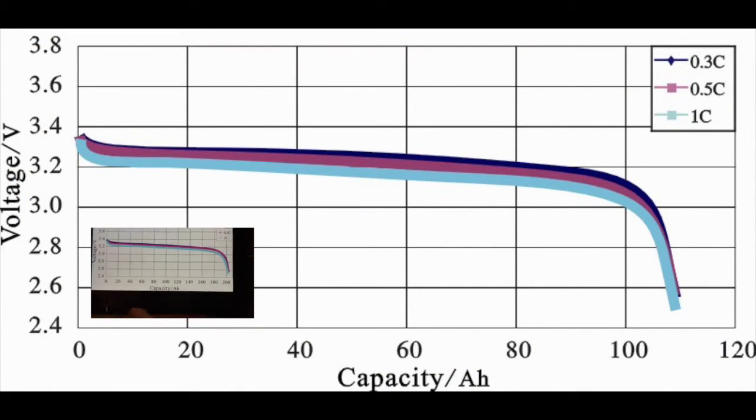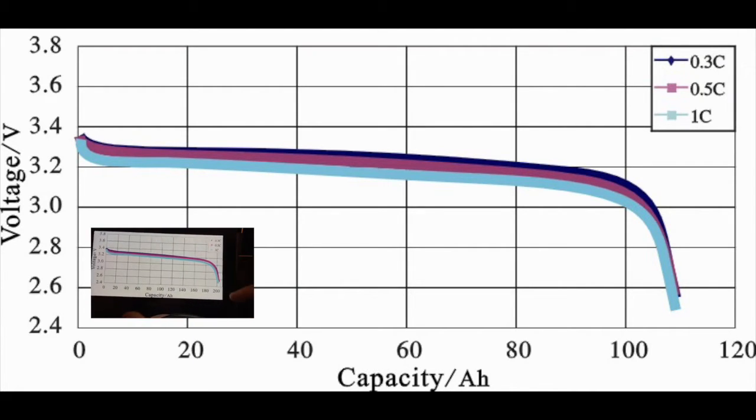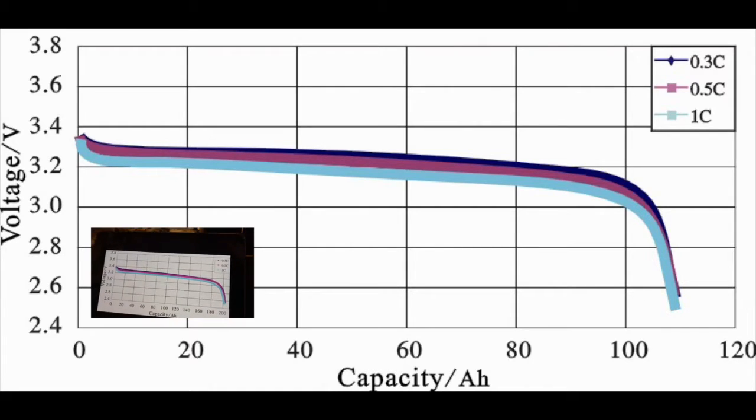I want to show you this discharge curve image for lithium. You can see the thin top blue line — that's 0.3C; we were discharging at 0.1C which follows a similar curve. By the time we got down to 2.5 volts, we're already over that drop-off. If we don't stop at 2.5, that cell is going to continue to drop and it's gone. At 3 volts, that's just where the elbow starts to end. If you're discharging at 1C, you're going to hit really the beginning of that elbow at 3 volts — that's where we want to cut it off.